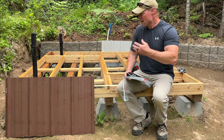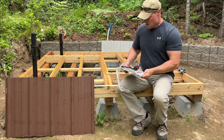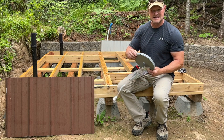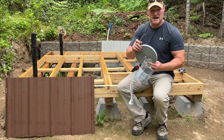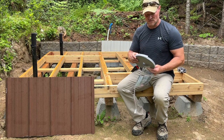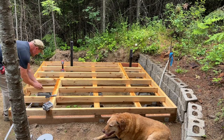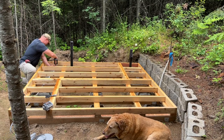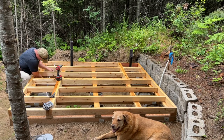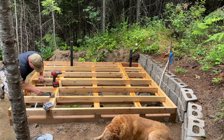But I thought before I lay the floor on, and it's raining so I can't lay the floor on, what I was gonna do is, they make this in galvanized metal too, which I use for my chimney, to secure my chimney, a cheap and inexpensive way to do that. I'm gonna use this heavy duty plastic pipe hanger strap, and I'm gonna put runs through here to retain my insulation.